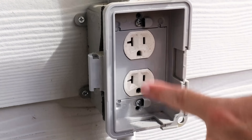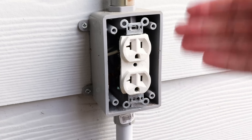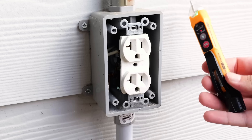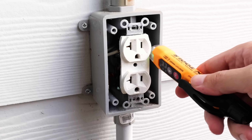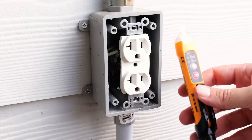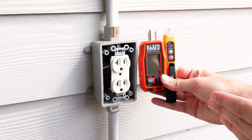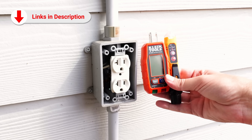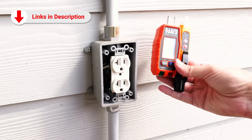If we were getting any kind of voltage detected, we would have one of these two lights illuminating, and on this particular digital screen it would also be showing us the voltage. Now we've verified that there is in fact no power going to this receptacle, so we can start working on it. I'll start out by removing the two screws — one on the top, one on the bottom — and that will remove the front cover. Even though I verified with the outlet tester that there is no power, I like to be extra careful once I get the cover off by using a non-contact voltage detector along the sides as well. Any of the tools and materials you see in this video, I'll have links down in the description below.